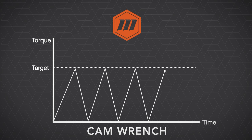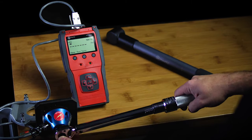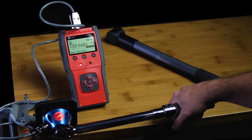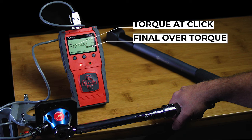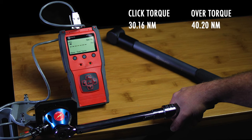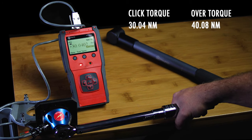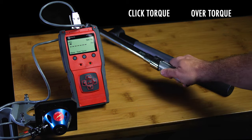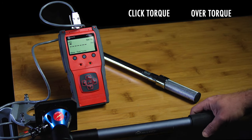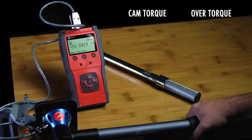Here's a quick video clip to demonstrate the difference between the click wrench and the cam over wrench. We have our torque sensor in our PTT torque analyzer, using it in first peak mode, which shows us the torque at the click and any final or over-torque achieved in the operation. You can see a consistent click torque at around 30 Newton meters, but also a consistent amount of over-torque at 41 to 40 Newton meters. With the cam over tool — set to about 31 Newton meters — every time the wrench cams, we will always be achieving around that torque value and never see any type of over-torque.